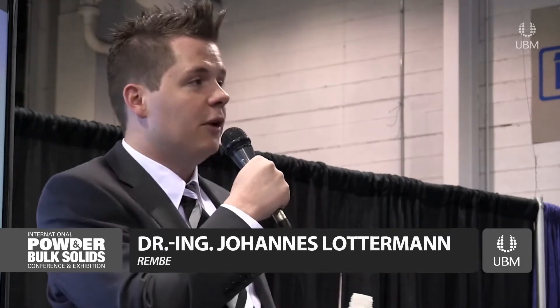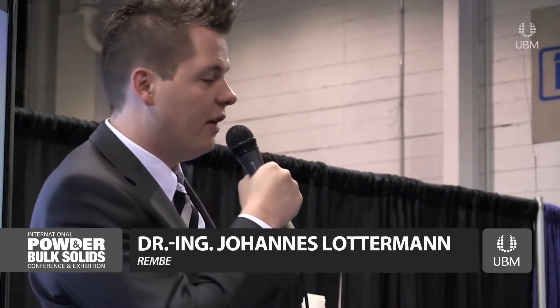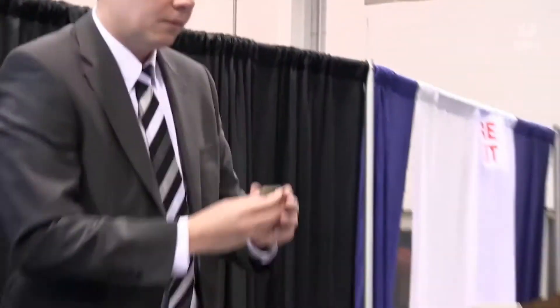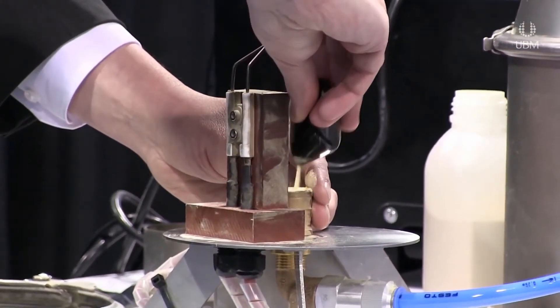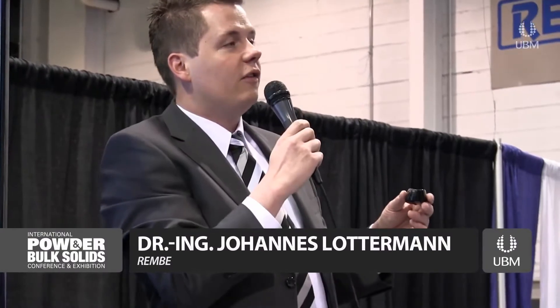Please allow me to do some preparation on the test equipment in order to whirl the dust up, get it airborne, ignite it, and then show you how a dust-explosion-prone vessel can be protected by means of explosion venting. As you can see, this is just a very small amount of dust — not the typical amount handled in your facilities, but just enough to create an explosive atmosphere in my test vessel.